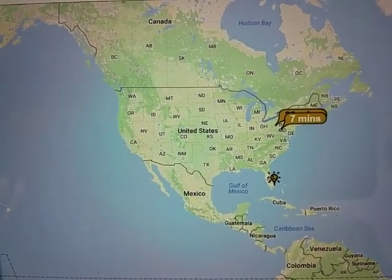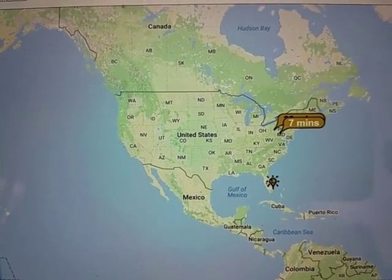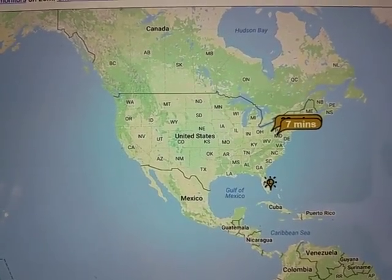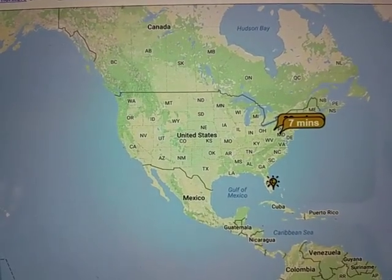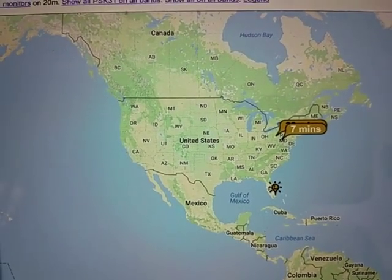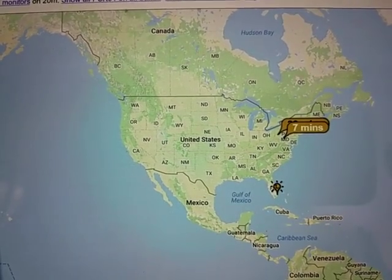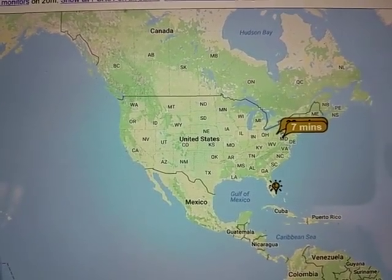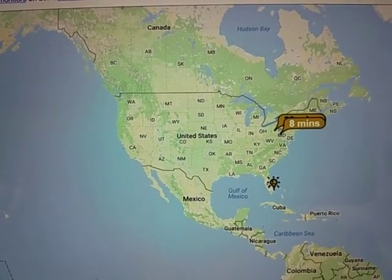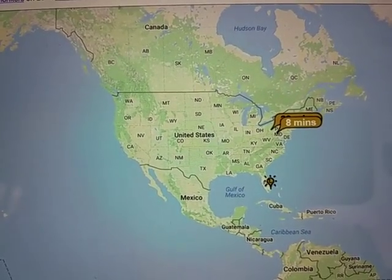It is usable — I would bring it and I will take it. But like I said, if I had a choice, I will take that vertical antenna anytime: a collapsible vertical, especially one you can extend to a natural quarter-wave length, such as for 20 meters or higher frequencies — you are probably looking at very good, predictable results. The loop will do its job, but it will require a little bit of effort and work. This is what I had to share regarding the MFJ9232 pocket loop tuner.